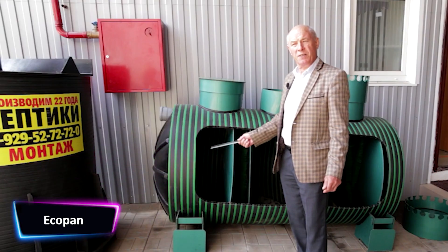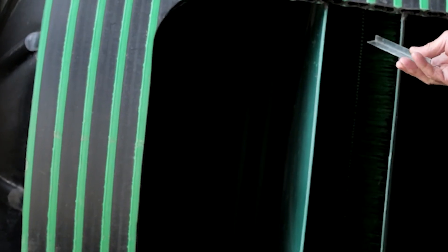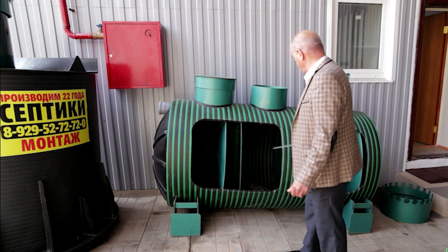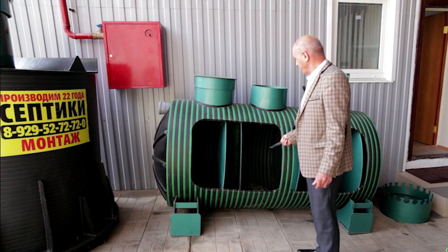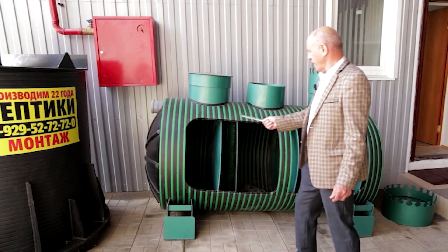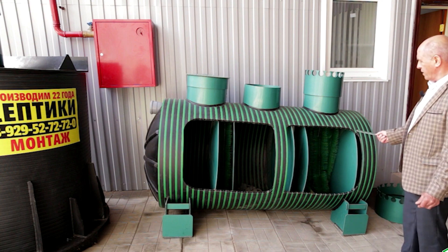The molded bottom cylindrical septic tank is made of high-quality, low-density polyethylene, equipped with two-layer walls and many lateral partitions that increase the strength and rigidity of the product. Wastewater enters a receiving chamber with additional walls that capture the solid portion of the waste. From the first chamber, the clarified liquid is poured into an anaerobic bioreactor where an intensive process breaks down the waste mass into activated sludge.